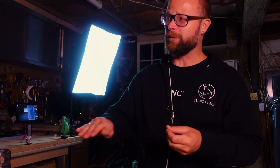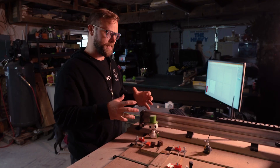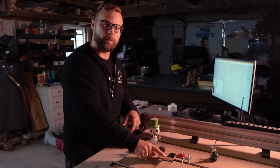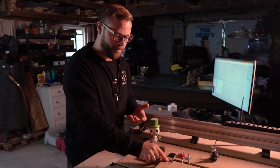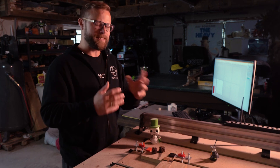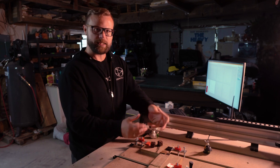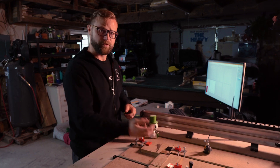This is a good place to mention limit switches. While this jig is wonderful and simple, if there is a machine error where it loses its zero, you are at the mercy of guesstimating back to where your zero point was. If you had limit switches set up, you would be able to go back to your home position and pick up where you left off. That's going to be another video coming out shortly — be sure to check in for that one. But for now, we kept it simple: just a really easy jig, six flips, six different carves, and you've got yourself a set of Oogie Boogie dice.